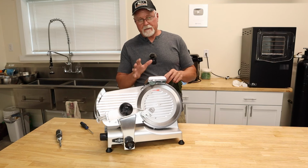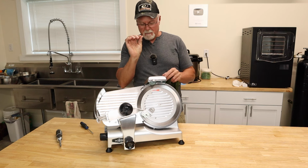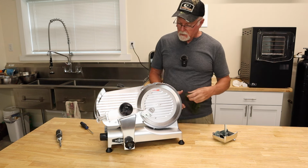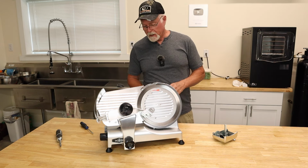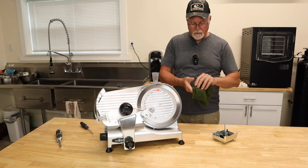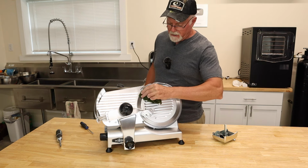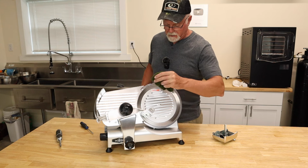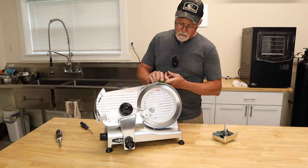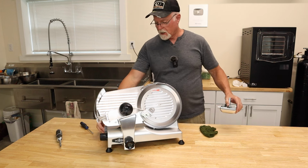All right, so after sharpening it, you're gonna have a little bit of dust from the wheel and a little bit of metal powder from the stainless steel blade. Take this off. Now remember, this is super sharp. You gotta be real careful. You turn the machine on, get a damp washcloth, of course. Fold it up a few times. Get your fingers away from the blade and just kind of wipe the blade with it like this. And the very back part, get your fingers away from the blade and just rub it a little bit and that's done. Okay, and then shut it off.